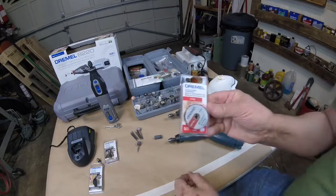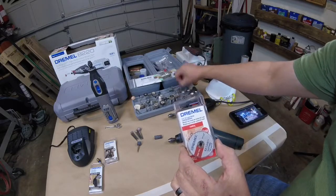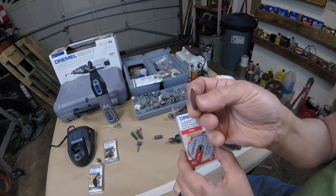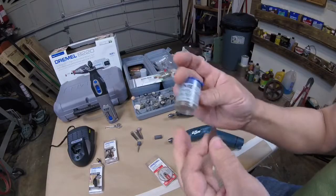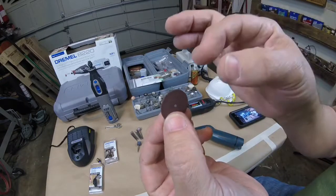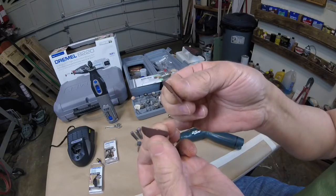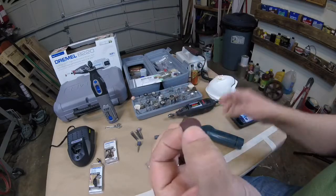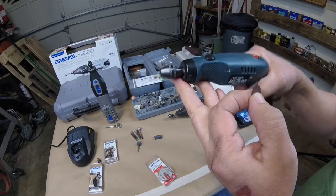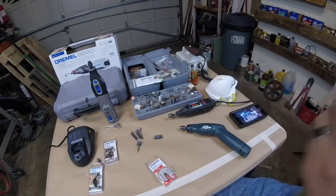Worth looking into. Cutting discs — this large cutting disc. You will get in a kit these little tiny, very fragile cutting discs. You'll get a whole container of them — 36 pieces. Just for an example, I'm going to show you how brittle and fragile they are. Boom. See how easy that broke? When this is spinning at 30,000 RPM and you're cutting into a piece of metal and you bend the blade, that thing comes flying everywhere. So — eye protection.